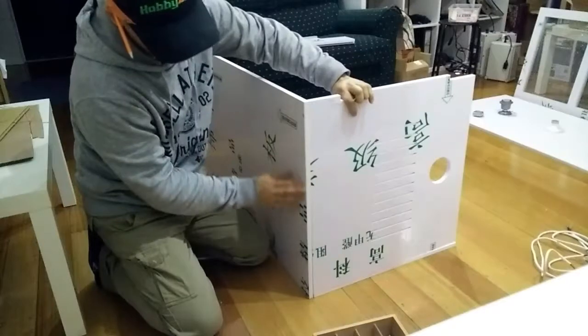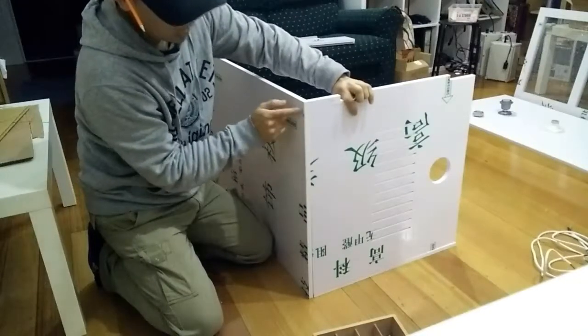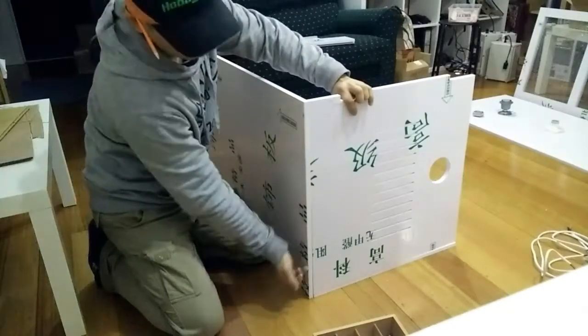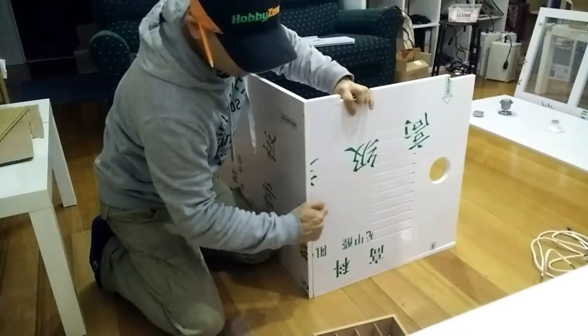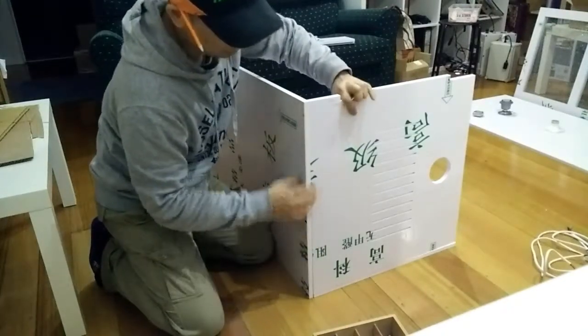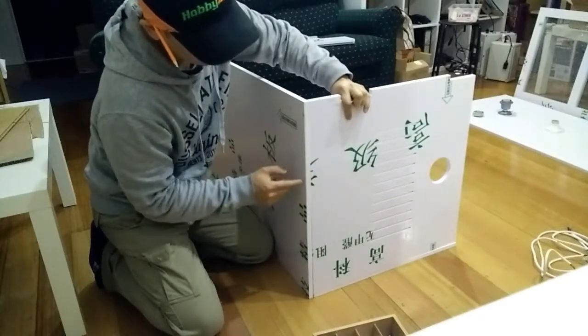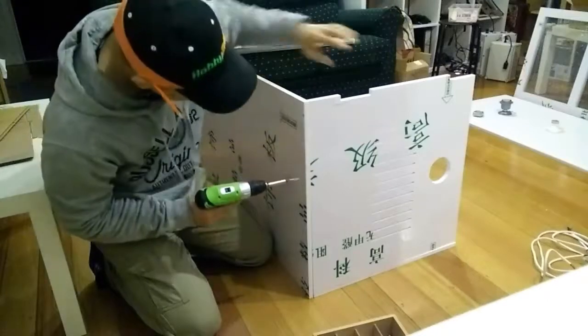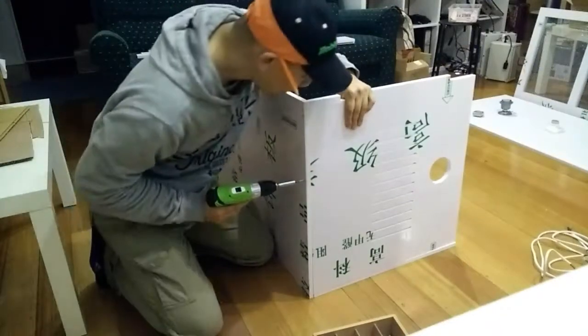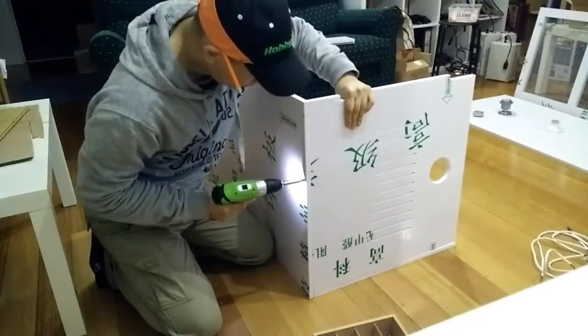Align the next one. When you do screwing for this kind of work, do it from the top to the bottom. Go one by one. Don't go one on top and one at the bottom, because if there's a bow, it's very hard to work with. So align it so that on the next screw, everything's flush. Same thing: put it in place and fire away.